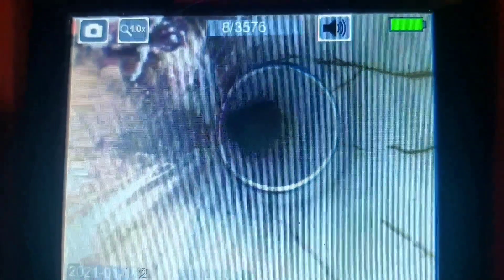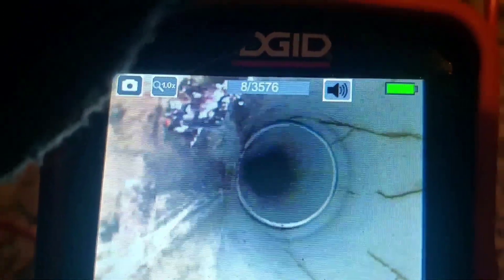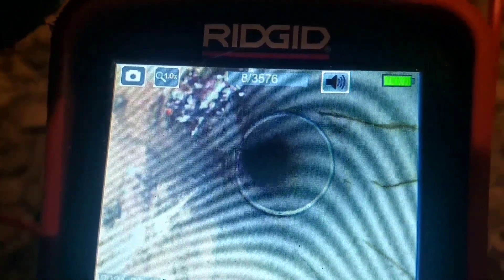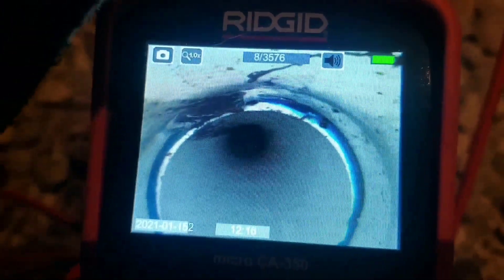It's pretty wild that it can maintain its shape through this kind of abuse. You have no hangers, outside forces, sharp points causing cracking — and if you're in the north, when you have freeze-up you're really in trouble. This material doesn't expand. You can see where connections were cracked at the bell joints. This pipe has been under a lot of stress these past couple of years. If it were indoors on a ceiling with hangers every four feet, it wouldn't have all these forces.